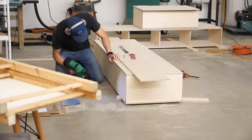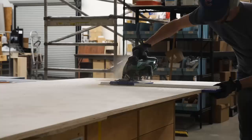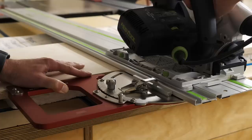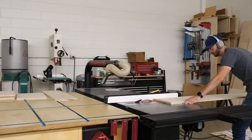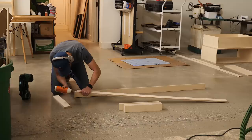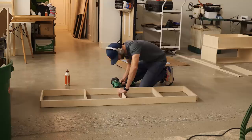The next thing I needed to work on was a few platform pieces that the boxes will rest on. After ripping off a sizable piece from the sheet I got my drawer fronts from, I cut a few chunks to the lengths that my platform pieces needed to be. Then over at my table saw, I ripped each of those into several pieces that are 3 inches wide, and to put them together I just used glue and some nails. I'm going for a base that's inset from the front and sides about 4 inches — making two for the long boxes and one more for the footboard box.